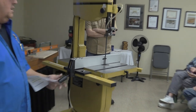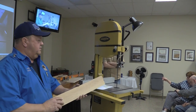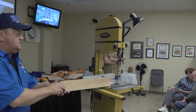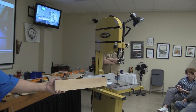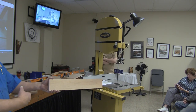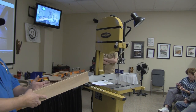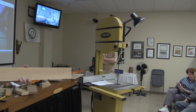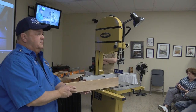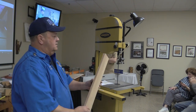When we were doing the Blancy bench, we had to resaw a bunch of different stuff. Some of it was like 5 foot long, you know, that you're taking a board and you're going across and you're sighting back this far. One of the things to do to make it safe is working with other people, just to hold the end up or something. Some of it was like 4 inches thick material and I'm holding it out this far trying to guide it into there. So getting somebody to help with that, but you can't get them to steer it, because two people on that does not work.